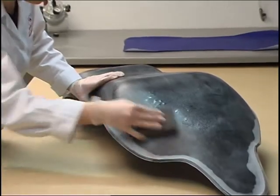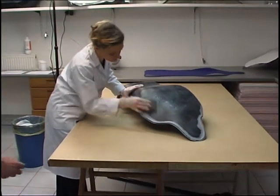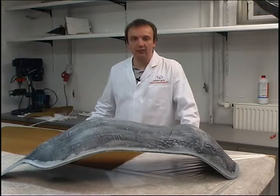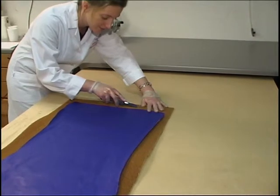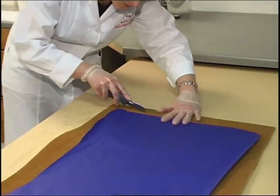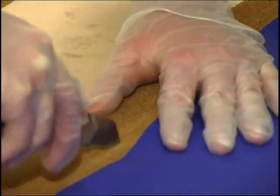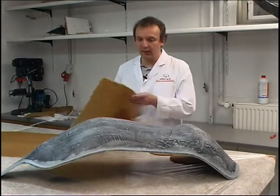Previously to continuing the laminating process of the dried GRP plies, the laminate must be thoroughly roughened. The recumbent bicycle seat exhibits adequate flexural strength and yet a low weight when it is manufactured as a honeycomb sandwich structure. This honeycomb sandwich structure is taken directly from nature and combines high wall strength and the associated high flexural strength with a very low weight. A key constituent of a honeycomb sandwich component is the honeycomb core, which is very light and, when unattached, also very flexible.